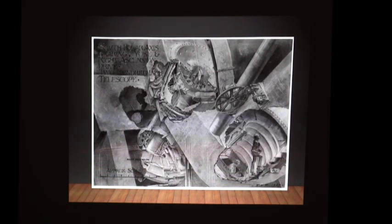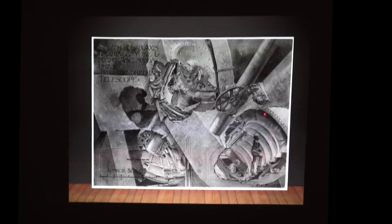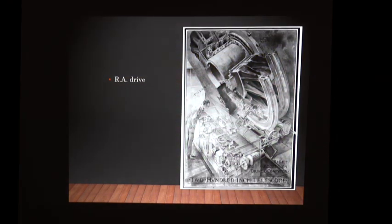This is an overview you saw before that showed grossly the paths, but then he started going into the details and drew these so people would know how to build it and have a concept. The area of the south end of the polar axis: the structural tubes that held the south bearing to the yoke were large enough to walk in, as shown here with a guy climbing up the inside. He pointed out you can put stairs in there — they have to be circular stairs because you don't know what orientation the guy's going to have to climb in. This is a detail of the south bearing, which had to be hollow because light could be going down the south polar axis into the spectroscope room at coudé focus — a coudé focus doesn't move as the telescope turns.